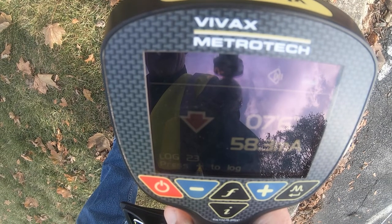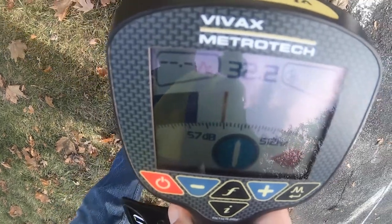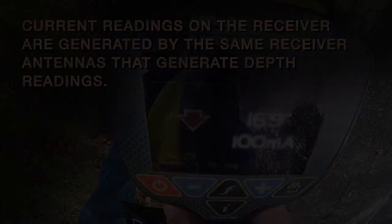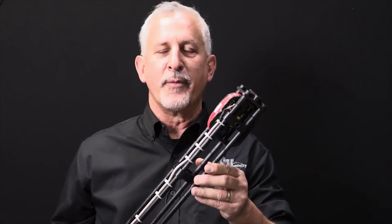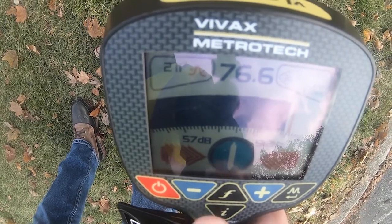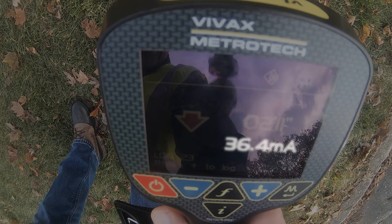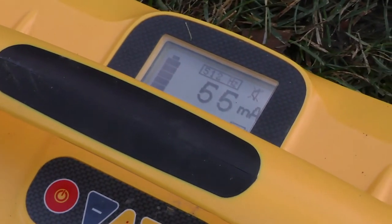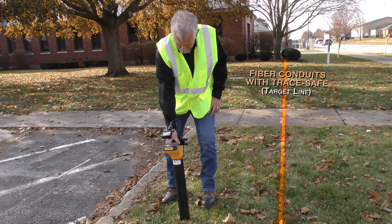And the depth display shows the deep earth depth. Here are the receiving antennas of the instrument used in this video — this is the bottom antenna and this is the top antenna. It's important to understand that the current measurement readings displayed on our receiver in milliamp units are merely an estimation. They are calculated the exact same way that depth is estimated. It's impossible to say you don't believe your depth but do believe your current measurement readings. The milliamp number on the transmitter is indeed a true number — it's representative of the amount of current flowing out of the transmitter and back through the ground.